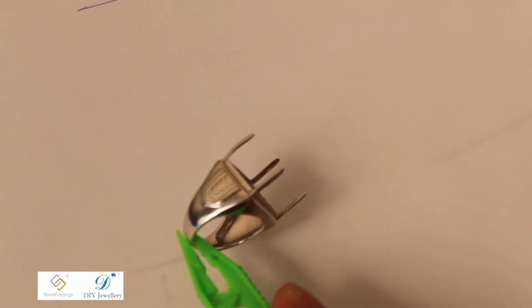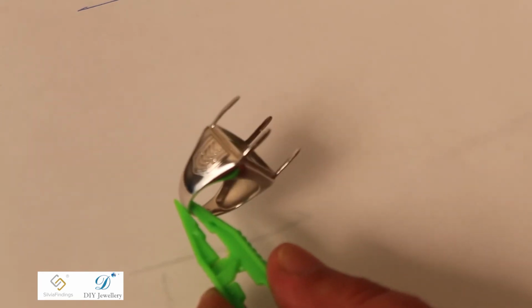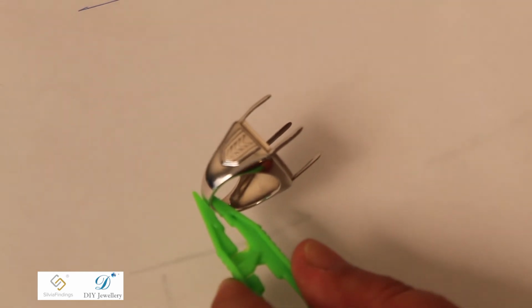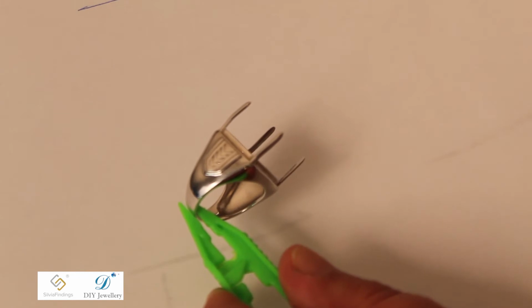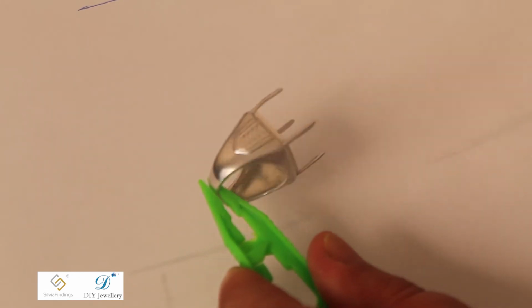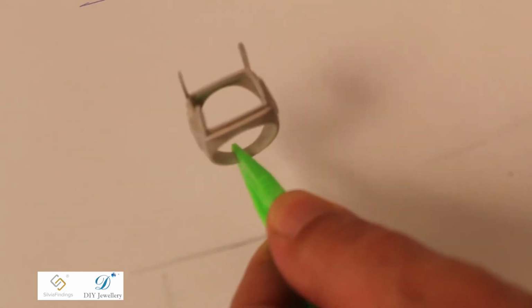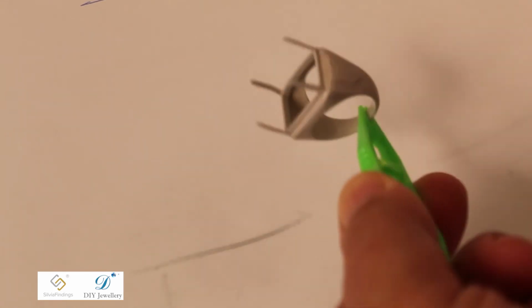So first things first, the jewelry scanner uses light and reflections of light to accurately scan the exterior surfaces of the piece that you're scanning. So reflective surfaces like silver, gold, don't work really well. So you need to have another coating on the surface, and you can buy a 3D scanning spray. You can just spray on the surface of that, and that will make the surface opaque.